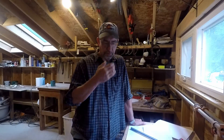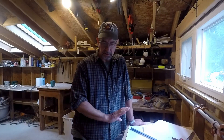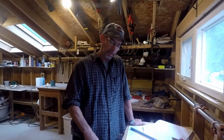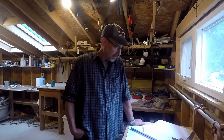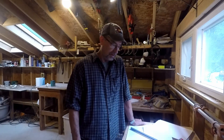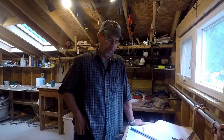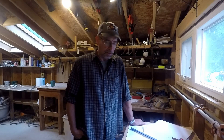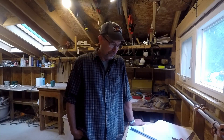One last thing: we're not going to paint it. I've always enjoyed natural finish wood, so we're going to put clear epoxy with thin fiberglass cloth that you won't even see to make it really strong, and then urethane over it for a natural wood finish. It's a smaller boat, something you can design yourself with the features and dimensions you want, and it's going to be relatively easy to build. Wherever I go sailing mine, people come up and want to talk about them. That's a little introduction to our project.